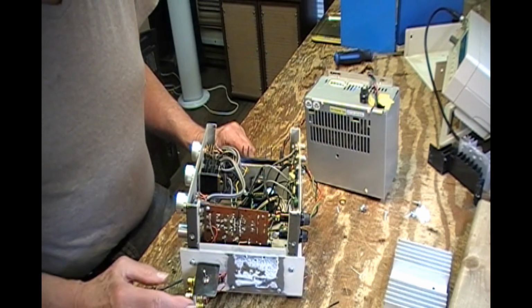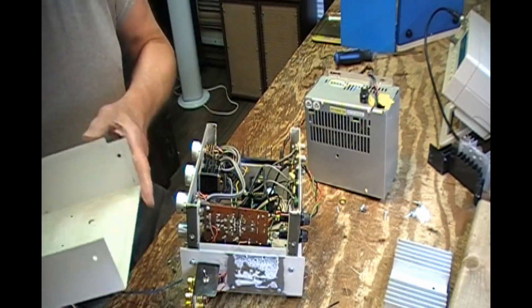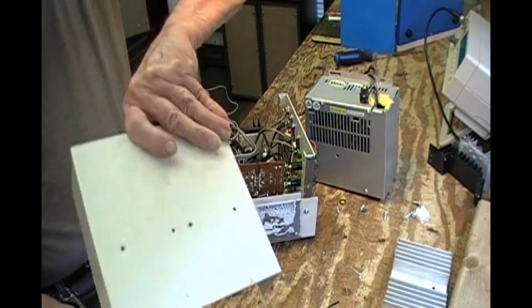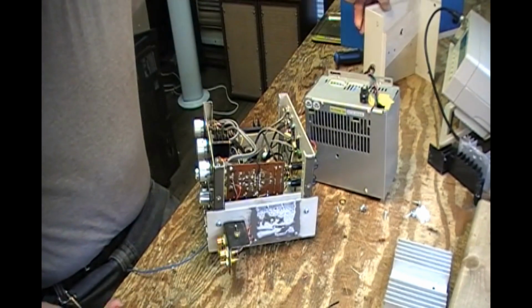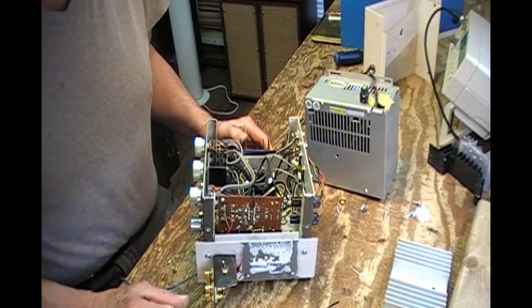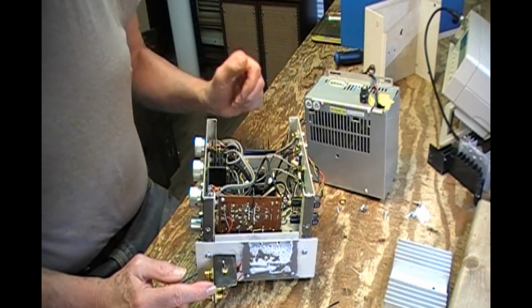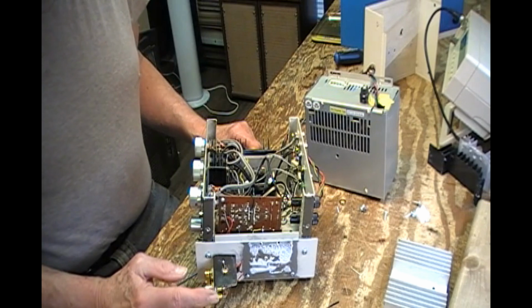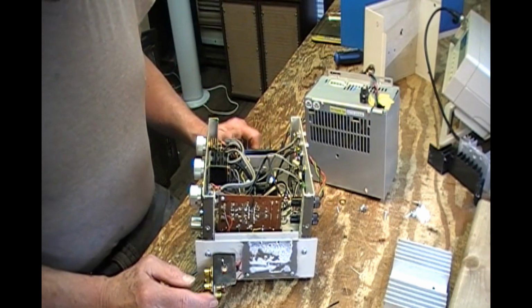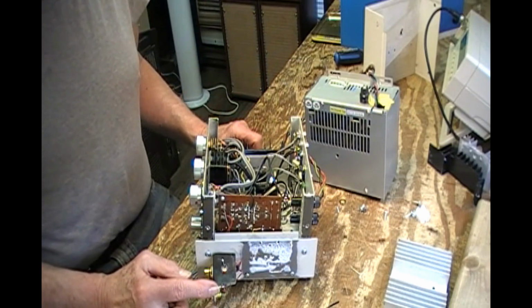And the thing that I'm aware of, the original, where's the top? The original setup before I put these in was 2 flat pack power ICs mounted there and there. Now that's the top, right? And eventually they failed. They were ancient. SG Industries, I'm not sure, SG 1010 or SG 1020, really old original metal encased ICs. They worked fine with this. But when one failed and they were no longer available, I opted to replace both of them with these. And that's when I discovered this little hum problem because of that slightly elevated or isolated ground system.